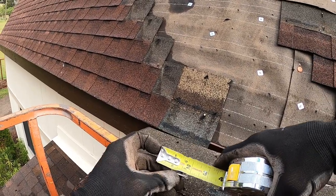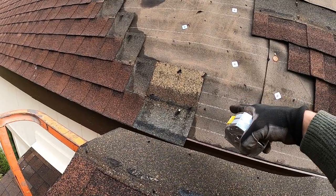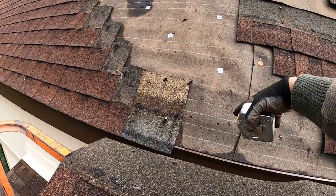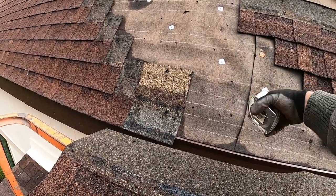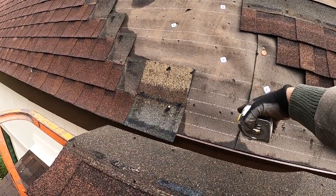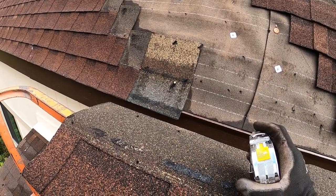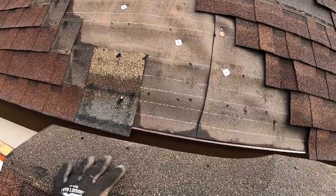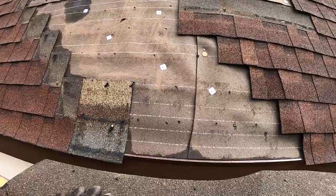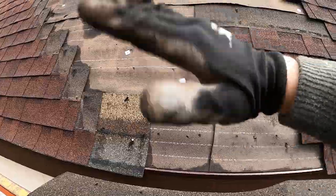That is a 1-inch roof nail, and definitely not the length you want to use if you're re-roofing. You want those nails long enough to penetrate your top layer, your tar paper, your bottom layer of asphalt shingles, whatever paper they have underneath that, and sink it deep enough into the plywood underneath. So depending on where you live, you may want to check the code for the length of nails or the depth that you need to penetrate that plywood with. But you can fully penetrate the plywood and expose the nail underneath into the attic space. That's totally fine because everything's waterproof.